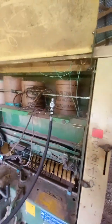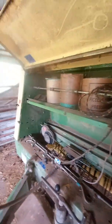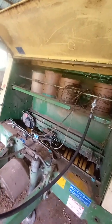The baler will pull from two baskets of twine — it's pulling from this one here and it's going to pull from this one over here. Once you tie in both of those and they're out, you'll tie in the next two. Make sure all of it is routed through the eyelets up here and everything is in working order, because these things are a pain if you screw up your tying mechanism.